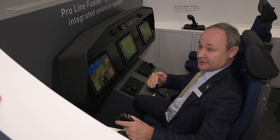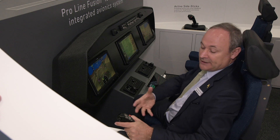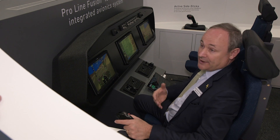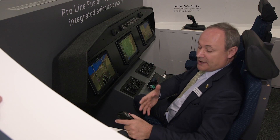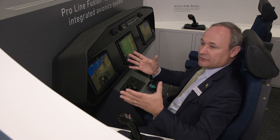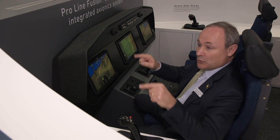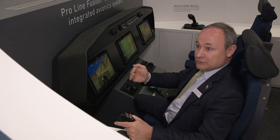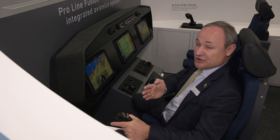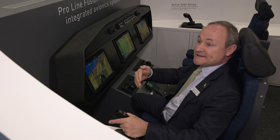When you get into different situations, we can increase the strength needed to move the aircraft, indicating to the pilot through tactile feedback that they're at high speed. Another feature we provide is soft stops, so we can program the window of movement with a certain effort required within a smaller range. When you reach a more dangerous area, we can provide a stop and require a much stronger effort to go beyond that soft stop and that safe situation.